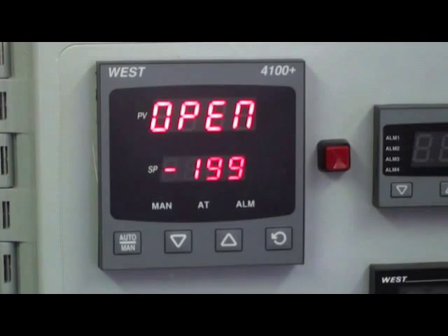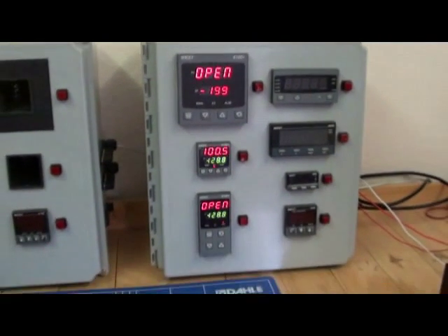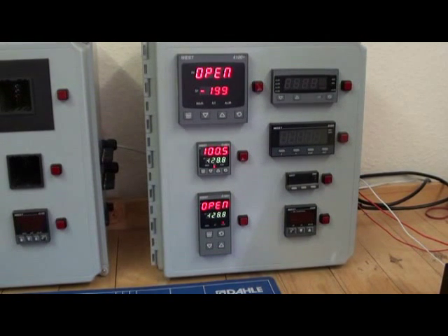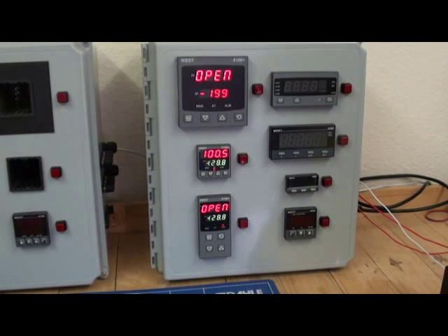The depth back of panel is 100mm. The controllers accept standard instrument signals, such as thermocouples, PT100 sensors, millivolts, and linear signals such as 4 to 20mA. The output, or outputs from the controllers, are by plug-in boards. Consequently, the base unit can be customised to each application as required.